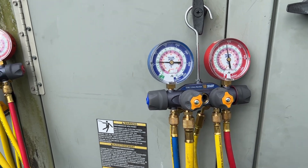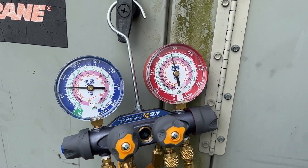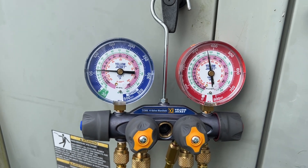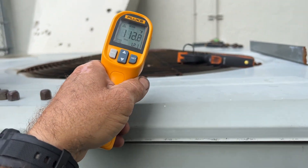We've been running a few minutes. I went ahead and hooked up gauges to both compressors. Stage one is a little over 70 on the low side and 375 on the head pressure. Stage two is 60 on the low and 360 on the high. It's R22, so that head pressure is a bit high. The coils are a little impacted with some dirt, and I'm thinking there's some corrosion on the bottom. Probably need to go ahead and wash them — that'll probably bring down the amp draw and head pressure.